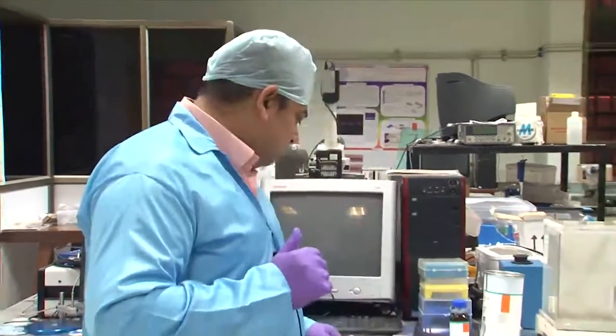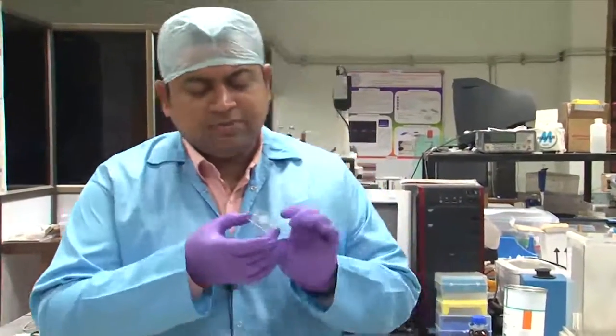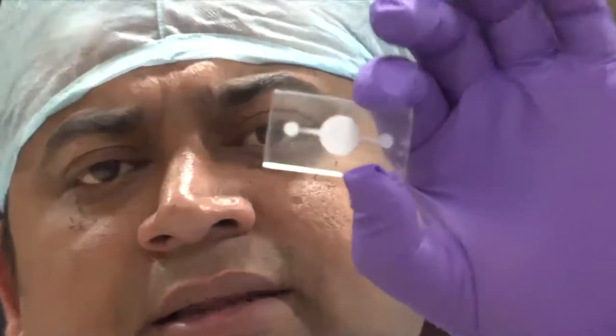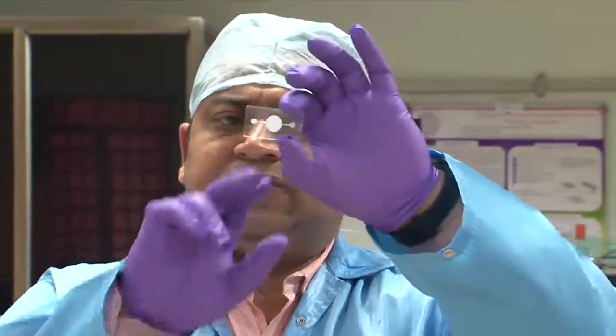If this is poured on a small laser etched surface, the surface gets replicated and the negative of that is created onto the surface of the PDMS. I would just like to recall what we did in the last module, where we actually made a device using CO2 laser processes on PMMA. The etching resulted in this kind of feature being imprinted on the surface to a depth of about 14 or 15 microns, with various widths and dimensions visible on the central chamber and the chambers on the sides.